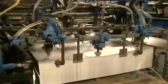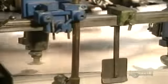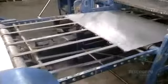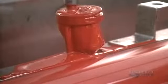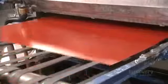The caps are made from these 1 square meter sheets of aluminum weighing 450 grams. Some 3,500 thin aluminum sheets pass through this feeder. They begin by coloring the aluminum sheet with a colored varnish, a lacquer, and an ink. Then 12 minutes of drying is needed. The sheets that have been colored set off on a conveyor for drying.